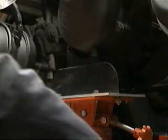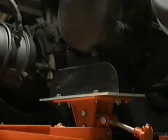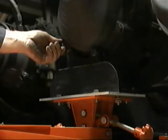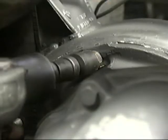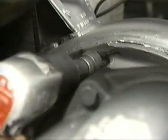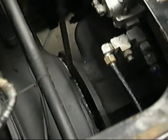Align the plate holes by adjusting the transmission jack table on the mounting plate. Then reinstall the two PDU cover-to-carrier cap screws that were removed and tighten them with an impact gun. Now remove the last carrier-to-housing cap screw. Use a large screwdriver or pry bar to back the carrier off the housing studs and pull the carrier.